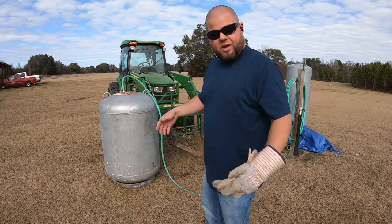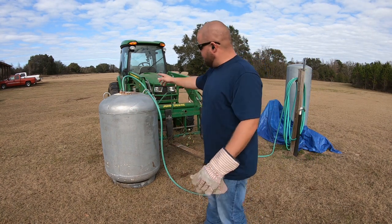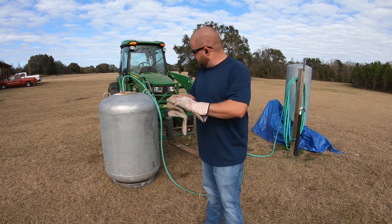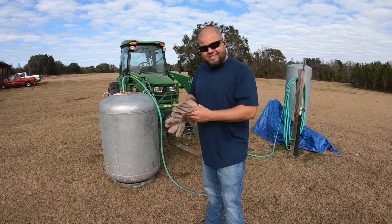All right, so now we just wait, filling it up completely with the water until it shoots out that second hole that I opened up for escaping the air and gases. Flip it over, dump it out, then it's safe to cut.